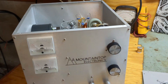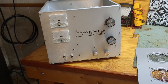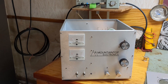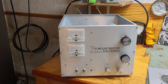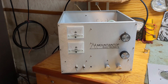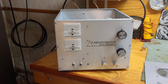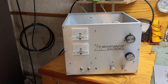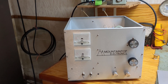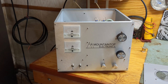All well-built 3-500Z amplifiers give you between 10 and 12 times multiplication. If you put 100 watts in, you usually get 1,000 out; put 200 in and you get 2,000 plus out. That's just the way they are, especially when you're cathode-driving them like a regular linear, the way everybody's been doing for 100 years. My recommendation — I say it all the time — these tubes are good for about 1,000 watts apiece. So if you run this amplifier at two to three thousand watts, it'll run that way forever. You're not going to blow things up, burn the tubes down, or desolder the pins.